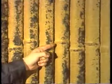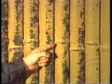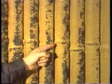Another water wall item to check out is construction welds. These joined the tubes together when the boiler was first built, and they're subject to leaks. Leaks in general are the fourth potential problem in the water wall tube metal.